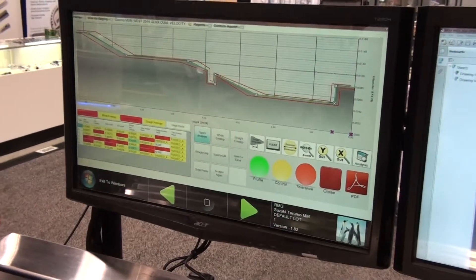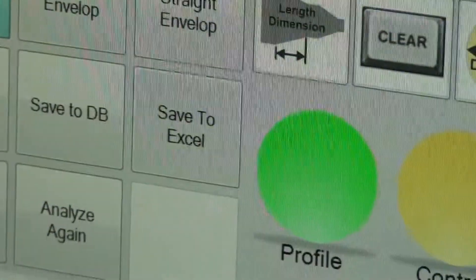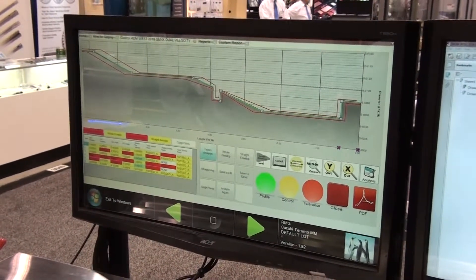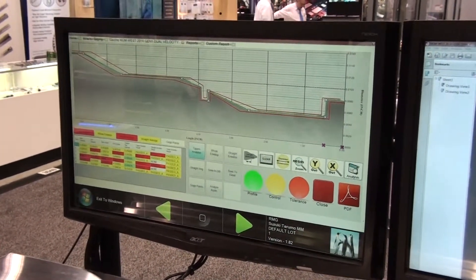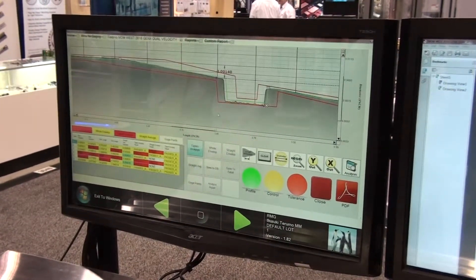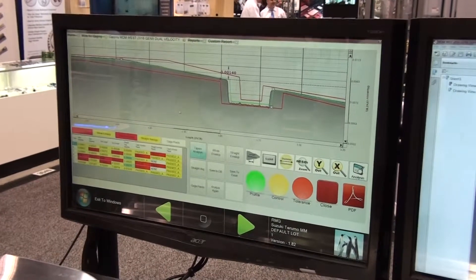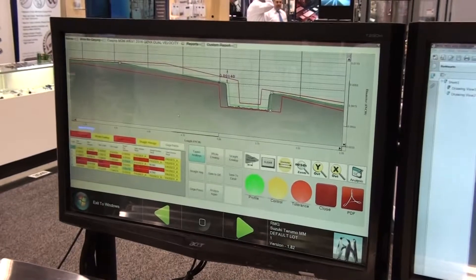The final result is compatible with Excel or Minitab. There are integrated SPC process capability, X-bar and range charts. Gauge points and flats are shown in the on-screen graph, with the ability to zoom on the graph while analysis results are shown. There is simple access to a report of analysis with results organized by user-chosen variables.